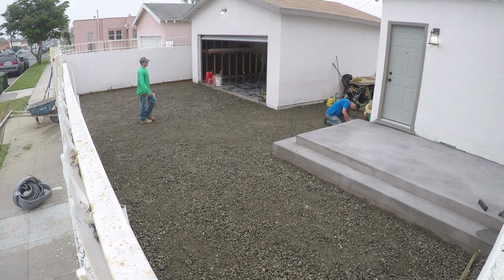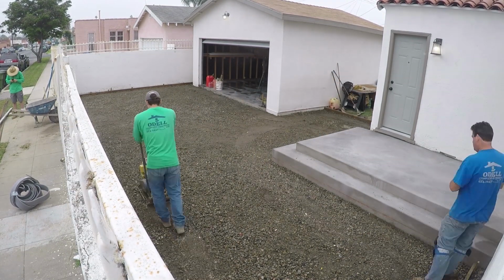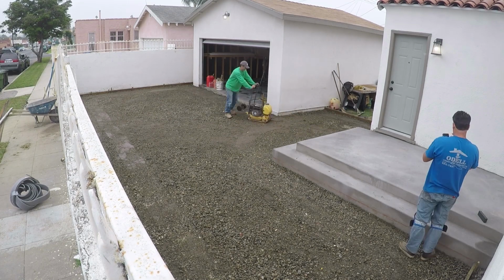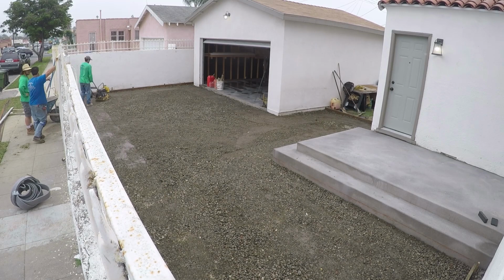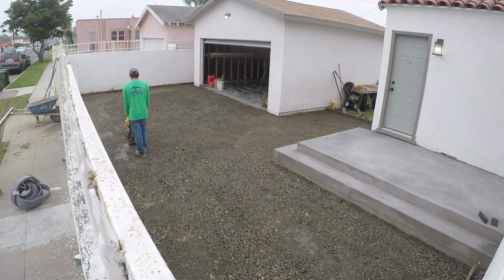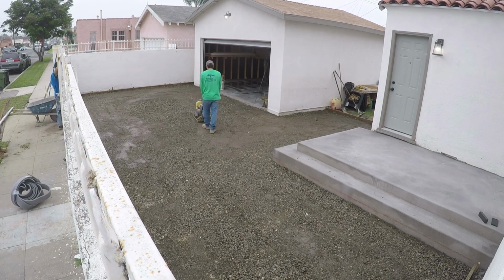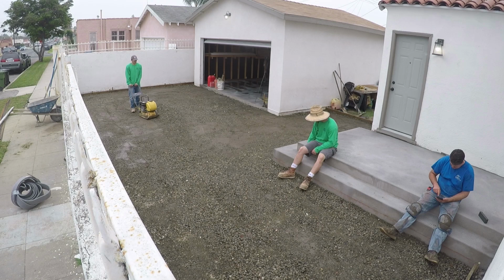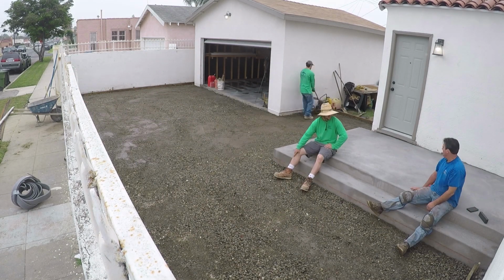And we're going to do a sand wash on this one. And we're going to try to match the driveway with the porch, even though that porch will probably get covered with a 1 foot Spanish tile. We're just going to show the difference between washing concrete, getting a sand wash the same day versus hitting it with a retardant and pressure washing the second day and see how closely those finishes match each other. This will show how necessary retardant really is.